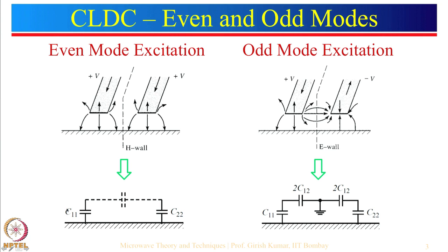We will define even mode and odd mode impedances. We know that impedance is given by 1 over j-omega-C. Compared to even mode, the odd mode capacitance is larger. If the capacitance is large then Z equals 1 over j-omega-C will be small. Since odd mode impedance has a larger capacitance, odd mode impedance in general is smaller than the even mode impedance.